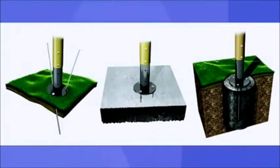At this time, you should also decide how the structure will attach to the ground. UPlay Today structures feature a unique footer system that allows the equipment to be mounted using 3 different methods. The 2 surface mount methods are ground spiking and anchor bolts. Traditional in-ground mounting into poured concrete footings is also possible. The following animation will give you an idea of how each method works.